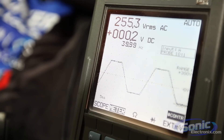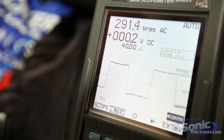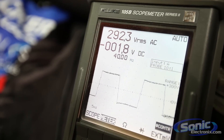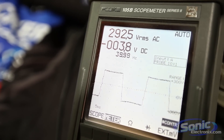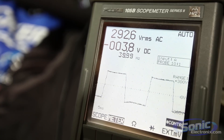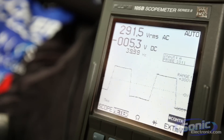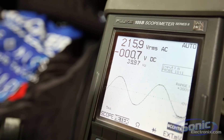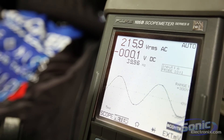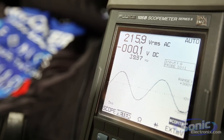We're getting 213 watts of power before it clips. I could keep turning this up and make it look like it's almost 300 watts, but if you see that sine wave, it's really bad and that's not how you'd want to play your music. Bringing it down to where the signal is clean, we're getting about 213 to 215 watts out of it before it starts clipping.